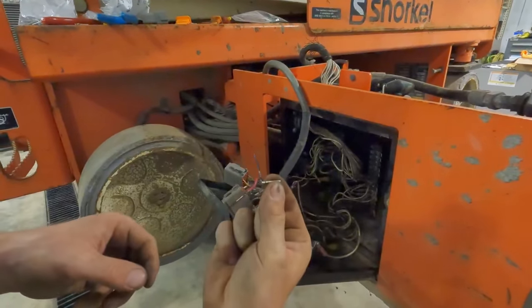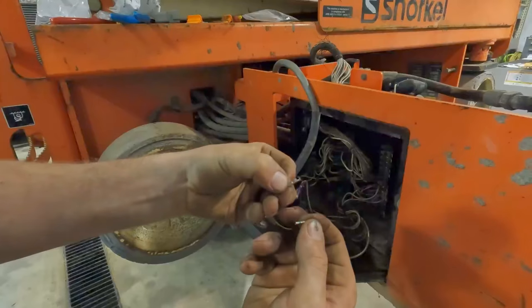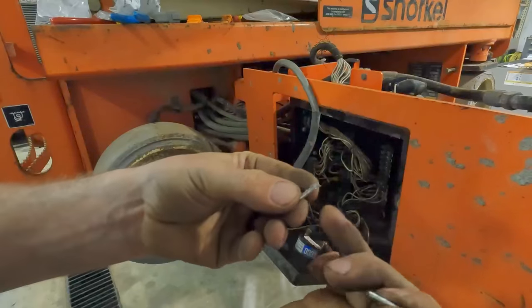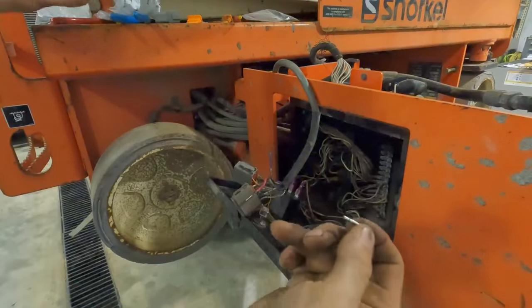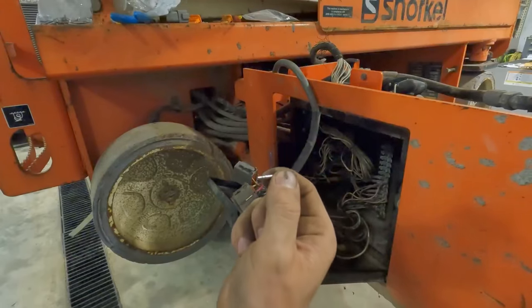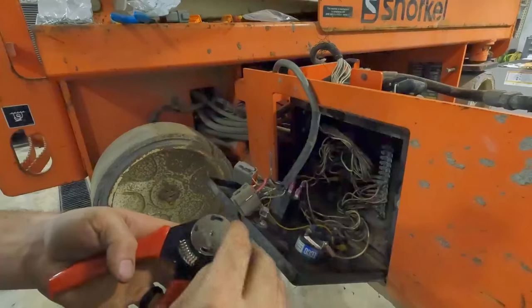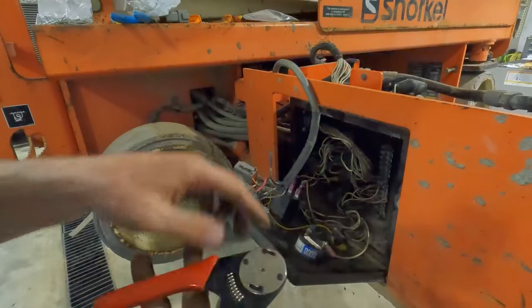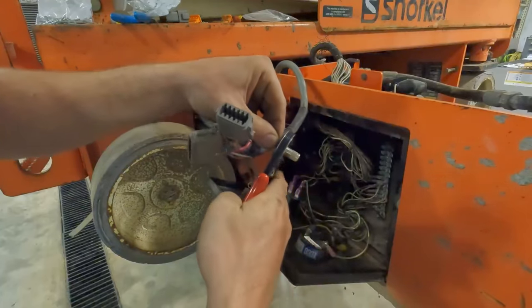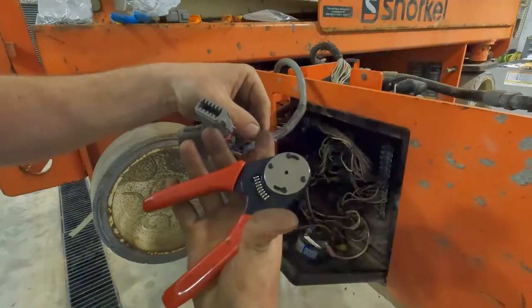So this guy is our new socket, which I need to install on that one that ripped off. The kit came with the open style, like this guy with the little fingers, and I'm not a huge fan of those. They seem to be finicky on getting those bent right. This is what I have for my weather packs. I have these for the other Deutsch connectors, and they're the same size, verified that on the socket, but basically this is your guy. You put it in there and that will stop it right where it needs to be. And then you put it in here and it'll force you to go through its full range of motion. If you go part way, it's stuck, you have to squeeze it all the way.